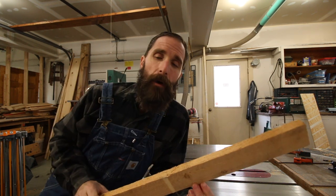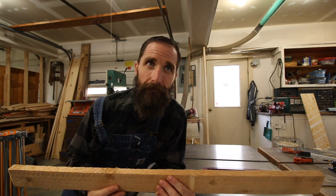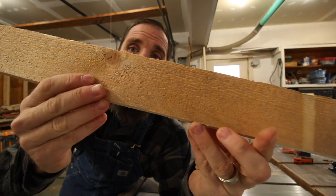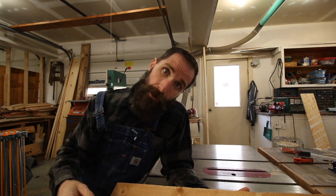Part of that stinks because they were planned projects, but not having to run out and buy materials isn't bad. I've been salvaging even the nastiest wood for this trim. At Home Depot they have really cheap one-by-eight boards meant for shelving - they're actually thicker than three-quarter inch but rough-sawn on all sides. To get it to the thickness I need, I either send it through my planer or run it through the table saw - down one side, flip it, down the other side.